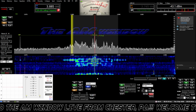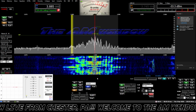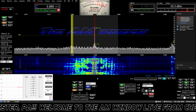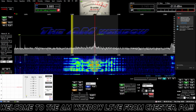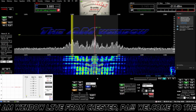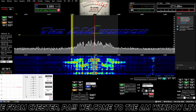Yeah, it's interesting to do it that way because when you build a normal modulator with tubes, it's a real high impedance to another high impedance, and that's what the mod transformers are. Those are the turns ratios you can get in regular iron, but I need to make 4 ohms present itself to almost 3,000 ohms, pretty close to 30 to 1, and I couldn't find any mod transformers, and they're expensive. The toroidal power transformers that Antec makes are so good, and the leakage reactance is so low. I just take 2 of them.